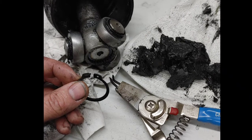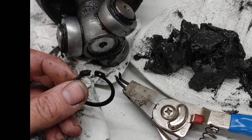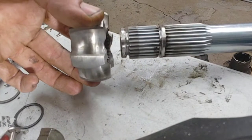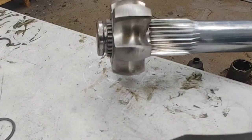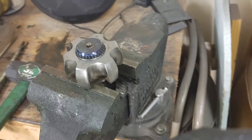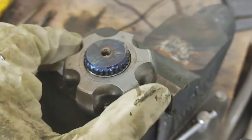This is a picture of the external snap ring from the inboard side, which got reused on the new shaft. The grooves that I cut — I used a grinding disc on a 4-inch grinder to cut those grooves in the new shaft. I basically replicated the OE shafts but that was not the correct fit. I ended up redoing this shaft by cutting a new groove in it, and there's a boss welded on the inboard side for the bearing race to stop on, then reused the snap ring on the end.